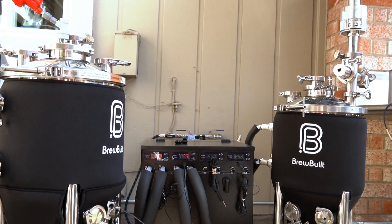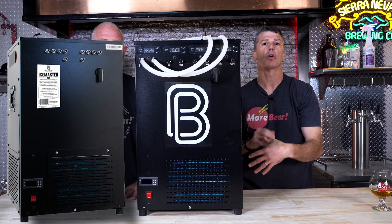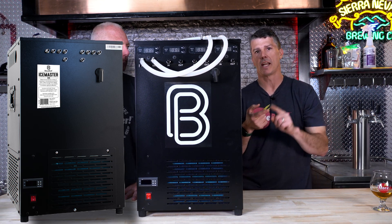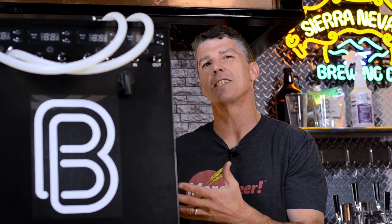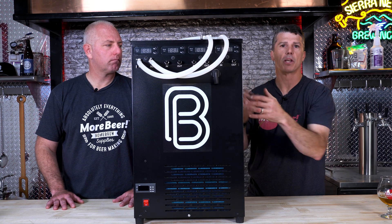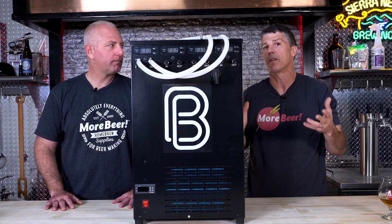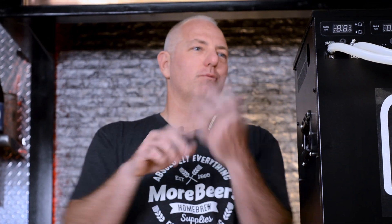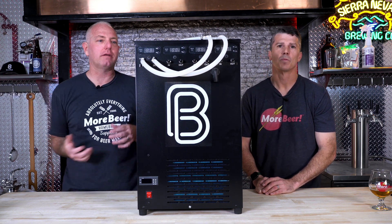The Max 100 looks very much identical to the Max 4, minus the four controllers, and it has bulkheads so you can hook up your own internals. It's a little less expensive, but you'll need a pump or pumps and a temp controller. We always say to oversize your glycol system rather than try to size it perfectly, because if anything goes wrong in your environment, it's really hard for an undersized system to make up. For example, when I was speccing out the brewery I opened, I had four tanks and wanted to cold crash all four in 100-degree ambient — I needed a five-ton chiller to do that. Ambient temperature, how you're cooling your tanks — all of that comes into the calculation.